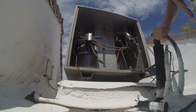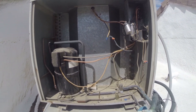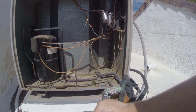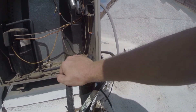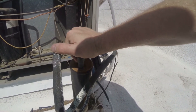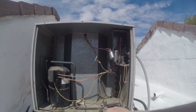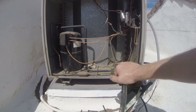That thing started up good. And look — there's a burn mark. Looks like it just arced out on the back and shorted out. Now we're in there nice and good; everything's getting nice and cold. Looks like we're good to go. I'll stay with it for about five to ten minutes, then come back and anchor that capacitor better. Check out my video on the plumber strap method — I think that's the best method for anchoring air conditioning capacitors. Nice and chilly. Thanks for watching Kung Fu Maintenance. What happened is that dangling capacitor touched the back of the unit and popped the fuses. We're good to go.